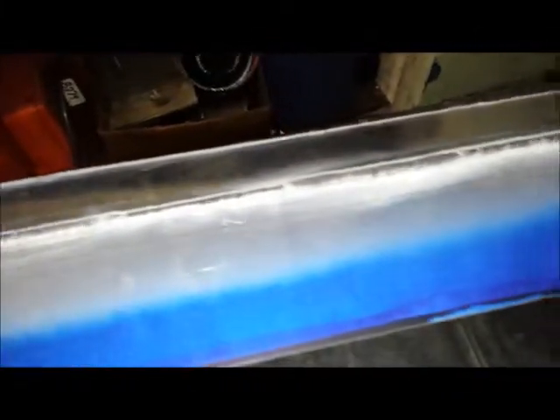We finished up the welding and it turned out not too bad. I was trying different speed rates and different feed rates. Now that I've got all the welds done, I've got everything blued, and my next step is to mark out where I'm going to machine the teeth.